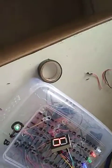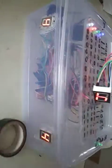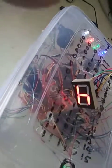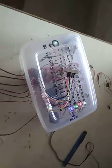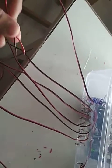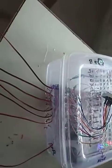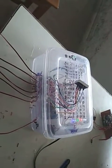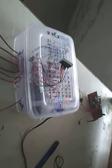The system is at zero again. Now we are going to press another key — say four. Four is pressed; here we can see the four is displayed. It shows four. The system is locked at four. If we press any other key, like one, nothing will happen — it is locked. So whichever user presses the buzzer first, that number gets locked and all others are rejected.